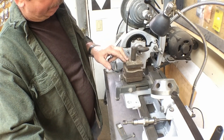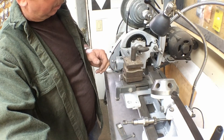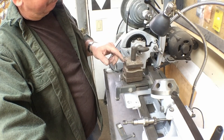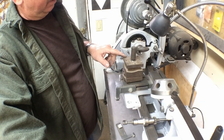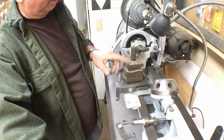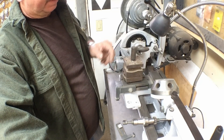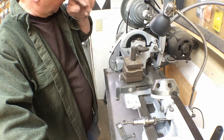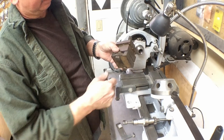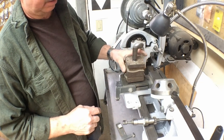This is one of the two tool posts that I've got. I've got one that's new old stock — still got the wood shims underneath, never been mounted on a lathe, all original. I think I'm gonna leave it the way it is. It's got a square nut on top of all the holders, which was original. This one has been changed — there are advantages and disadvantages to both ways. We'll probably go back to the 5/16 — I believe it's 5/16, maybe 3/8 screws — I'll have to turn some or order some. We'll re-blue the hold down nuts, T-nuts, and the bolts that go in and hold it in place.